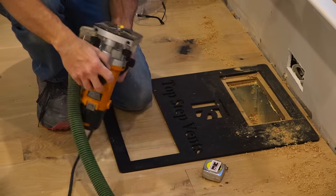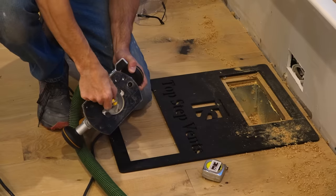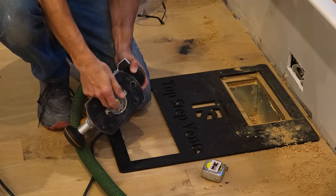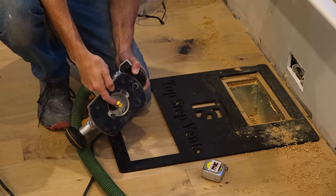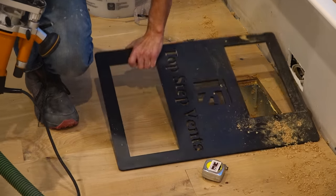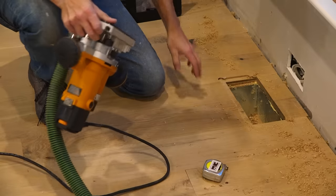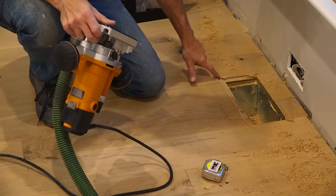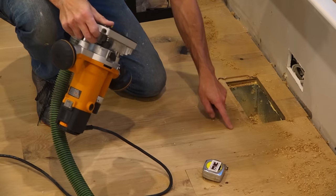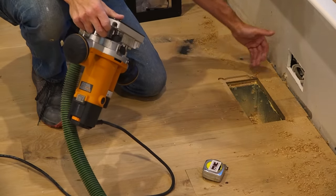I have never seen this before. The set screw that holds this block on here, that actually holds the bearing against the bit, came out at some point, so that allowed the bearing to slide up and for my bit to cut under the template. So now I have this situation going on. I will have to move my template over and make it off-center. I was trying to get it perfectly in line with my floor lines, but that's not gonna happen anymore. I'll come over this way and away from the wall a little more